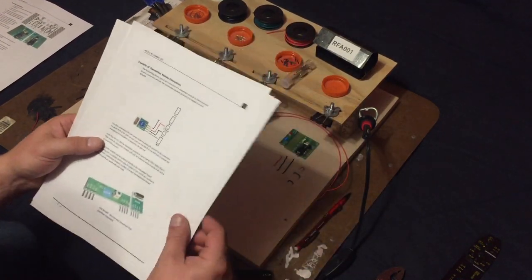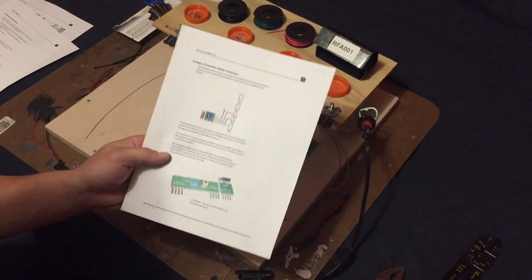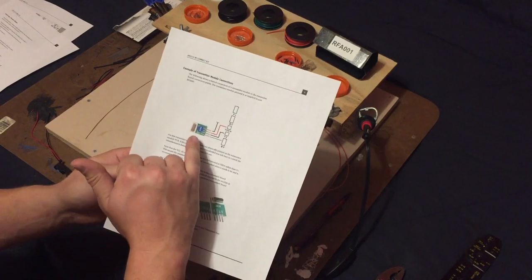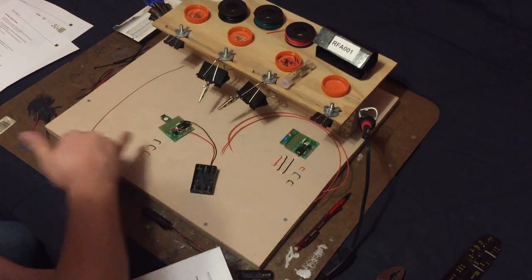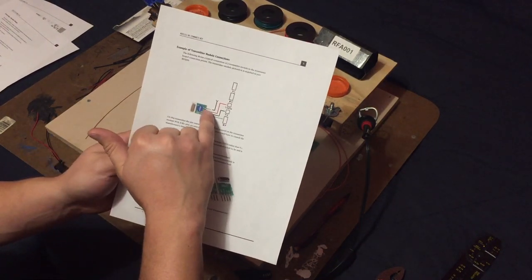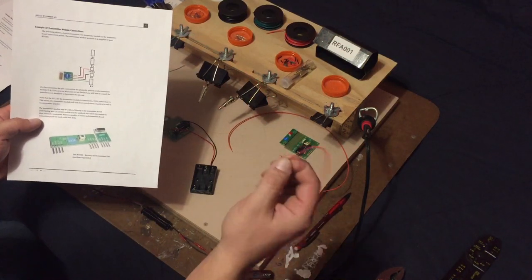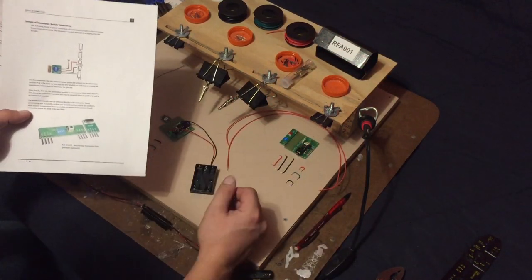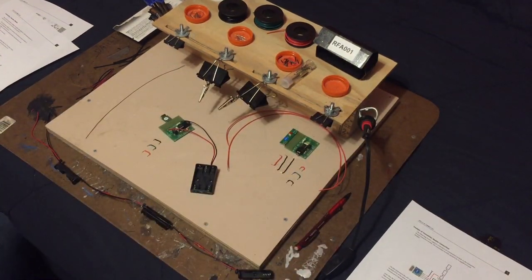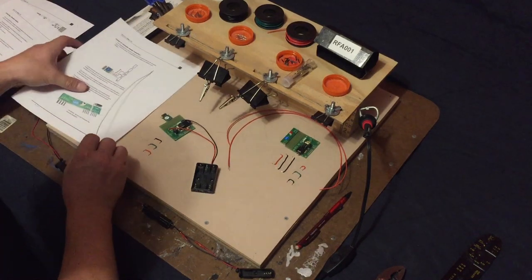So just to save time, like I said, I've pre-cut all these wires. So what we're gonna do first thing is solder this guy into place. Now, because I already have the wires bent, they should hold themselves into place. So I'm just going to solder one really quick here. Okay, now keep the iron on that, realign where I wanted it. Let it cool. Okay, and that'll hold it in position for me to solder the rest of the wire. So let's do that really quick. Okay, that's that.